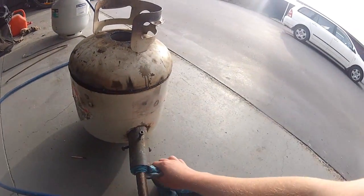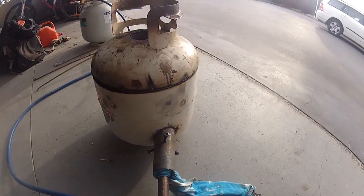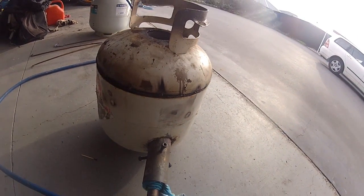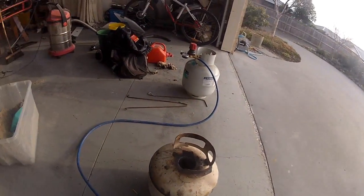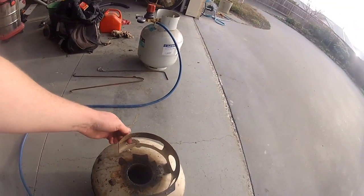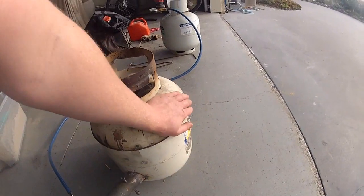The reason why I have this rag stuff in here is that it was storing far too much air in the space around the burner, allowing it to suck a lot of air. If you turned the pressure up on the regulator the flames went out - there was too much air rushing through. For quite a while I've been able to touch the outside of this without feeling much heat, apart from around this joint.